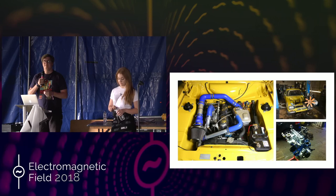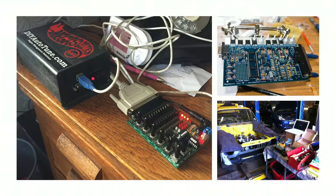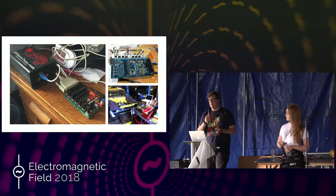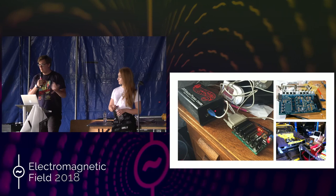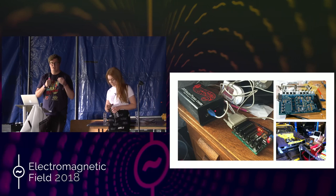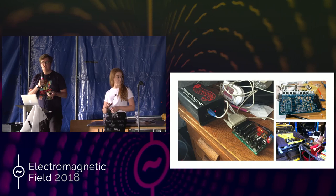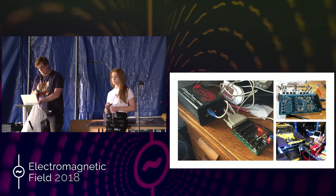It was nippy up until the point where it effectively melted a couple of the pistons, so it's been off the road a few years now. This is the MegaSquirt ECU — it's the main computer responsible for controlling the engine. It controls all the fuel, does all the calculations for the air, and controls the ignition coils. You can buy it pre-assembled or as a kit. I bought it as a kit from the US, soldered it together, did a lot of bench testing, got it working, put it in the car, started it — pretty good. It's a fairly steep learning curve, but once you know a little about cars and embedded electronics it's not too bad. It's a very capable ECU if you're willing to put the time in, and it's quite cheap for what it is.